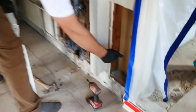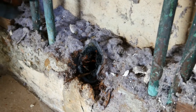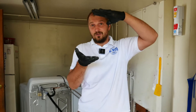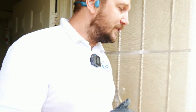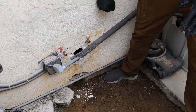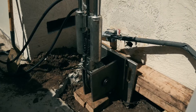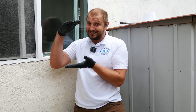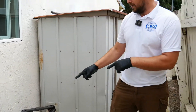The laundry line comes out over here and creates a drain for laundry and bathroom. The old broken drain is a dead pipe — we're not using it anymore. We bring a new ABS two-inch pipe for the kitchen. Because there's no room for equipment when the pipe is only six or twelve inches underground — it has to be at least two feet deep — and because it's a kitchen it always works this way: on the other side of the kitchen you jackhammer a section, dig down, and the wall supports the pipe bursting equipment. The wall and foundation give us support to pull the new pipe, since there's a lot of pressure on the wall.